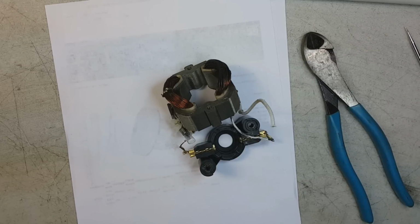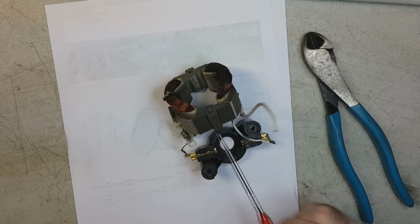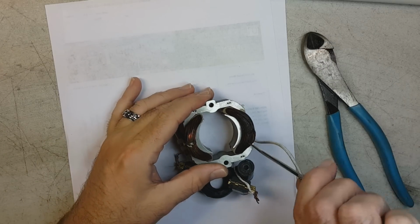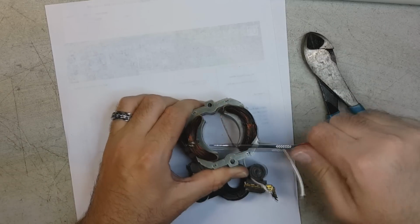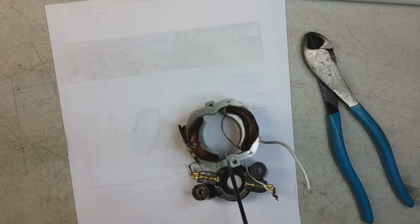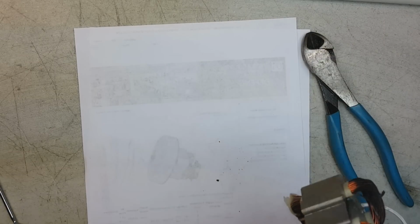Okay, on this lousy motor, this is an 8 amp motor, okay? It draws 8 amps, or over 900 watts, while it's being used. Through these windings? Really? Are you kidding me? Through these 22 gauge windings. There's one. There you go. Look. Okay. There you go, folks. That's meant to have 8 amps worth of power. Right there. Okay. So we've established the field coil is full of burnt shit and plastic.